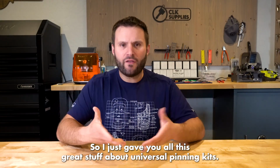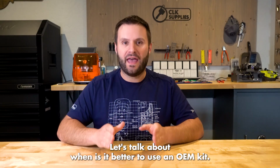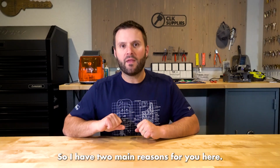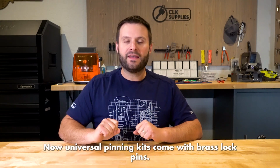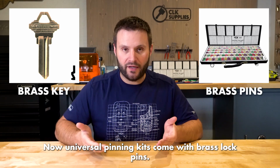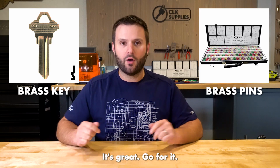So I just gave all this great stuff about universal pinning kits. Let's talk about when it is better to use an OEM kit. I have two main reasons for you here. The first reason has to do with the key blank material. Universal pinning kits come with brass lock pins. So if you're using brass keys, then using brass lock pins is fabulous. Go for it.